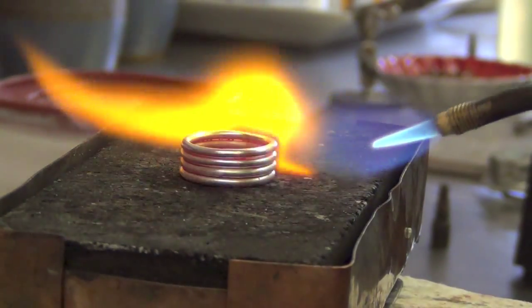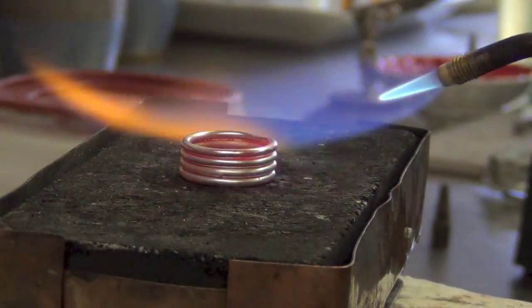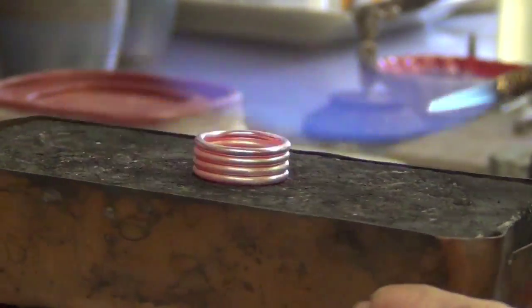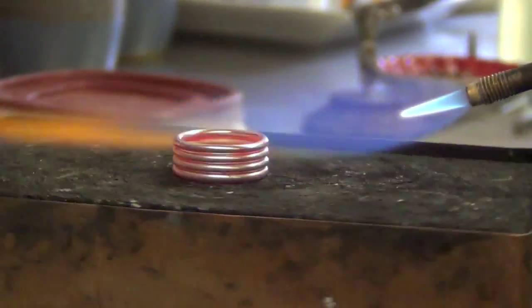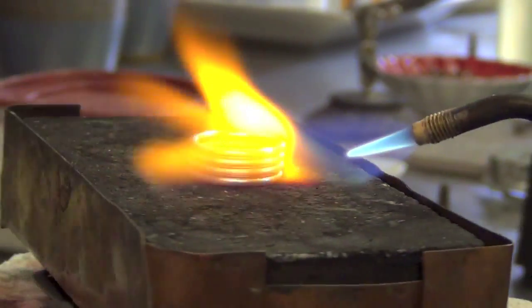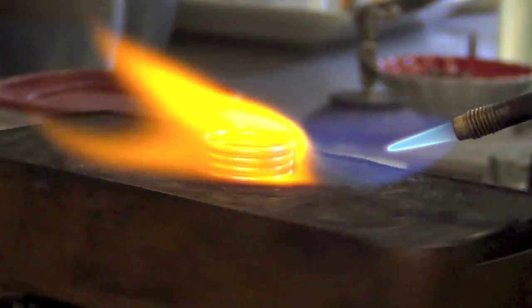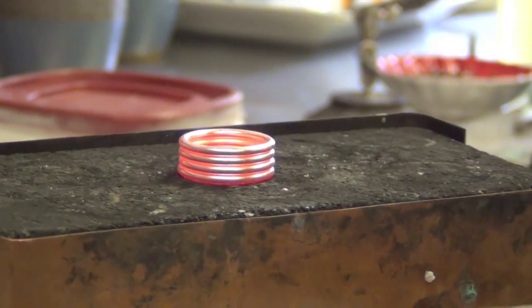So I'm giving it time for these to, once it gets to super annealed, it's past the annealing temperature because I'm where it starts to look wet, right? And I'm giving this time. They're starting to lay down. And I'm getting towards the wet look. Here it comes. Now, I just keep my flame in one spot and I spin my ring. Wow. Worry about it melting?